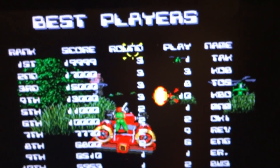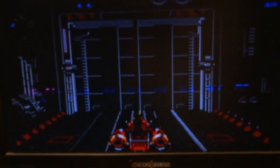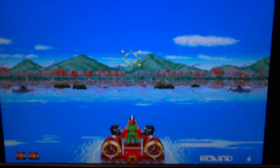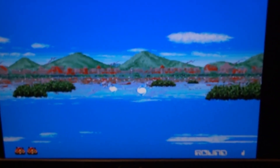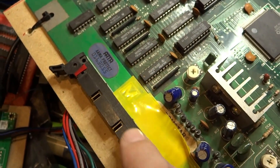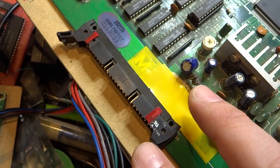I can coin it up here, add another coin, and actually start it. We can use a couple of missiles — I believe that may be the only input I have lined up right now. There are no proper controls, and the reason is that these boards require a specific IO board which I do not have. That IO board connects here to the M connector.